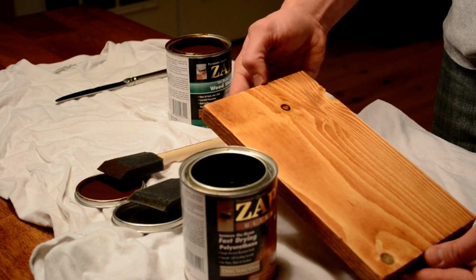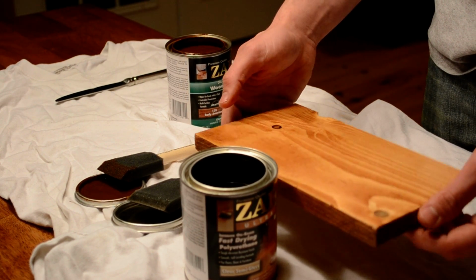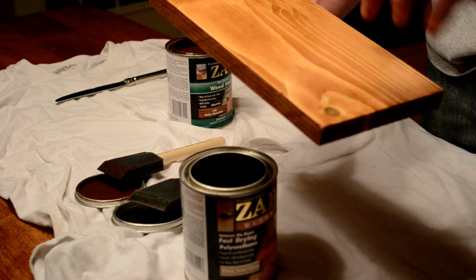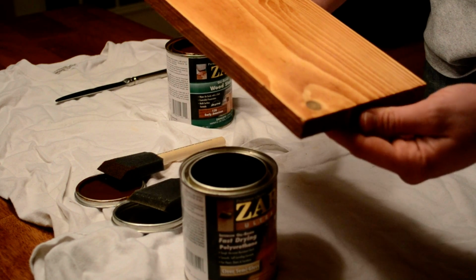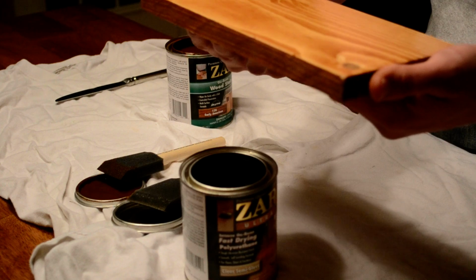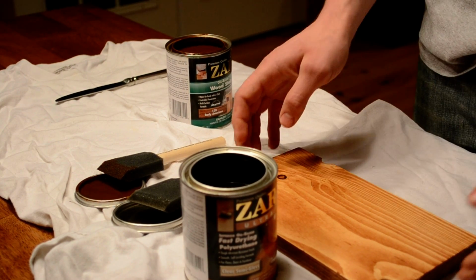My grandfather used to use Son of a Gun, which you would use for your car, actually, to clean the dash and things. If you sand this real good and squirt a little Son of a Gun on a rag and wipe that down, it's going to give it a really nice, slick, smooth feel that we use on all our furniture at the store, actually. So that's a little insight on that. But those steps are that easy.